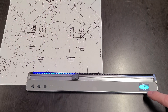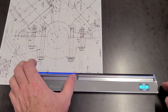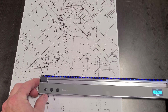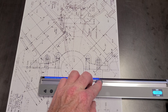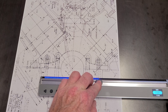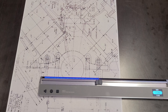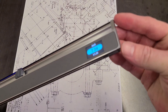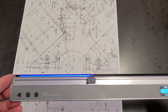This just so happens to be what I printed off here — 1 to 1.33 scale. So basically you just move it over and you enter 5.8 in here and it creates a custom scale for you. Then I can go up and measure things like the distance from outer bolt to outer bolt on the 4-bolt cap — slide this over and I see 7.27, probably closer to 7.25. This thing can also be used like a caliper — it's got attachments on the end, so you can use it as a straight caliper, you can do math on this thing. It's primarily architectural.